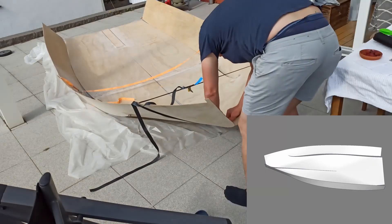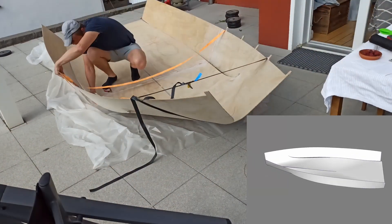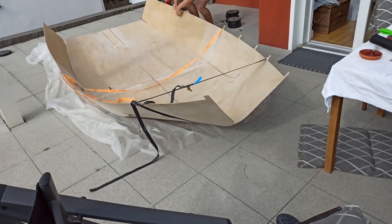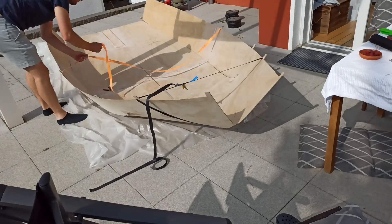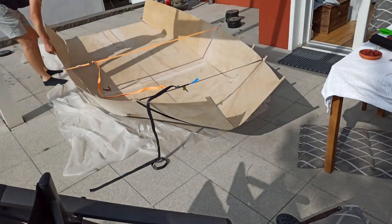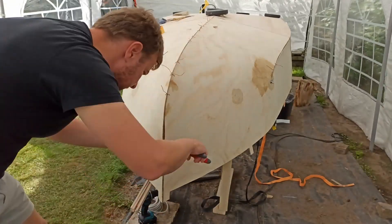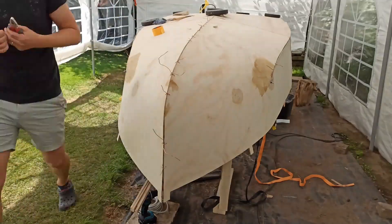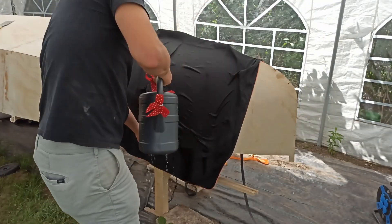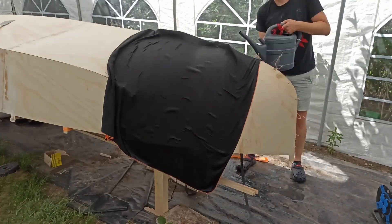It was difficult to transport due to the instability of the parts and I needed two helpers who were fortunately very careful. The tension in the bow area was already relatively high, so I left the bow open in the first step. Over several days I was then able to gradually attach and tighten the copper wires, which allowed me to close the hull, though the distance between the hull plates and the frontal bulkheads was still relatively large.